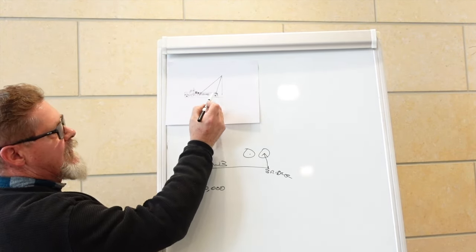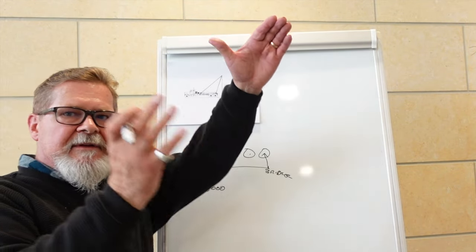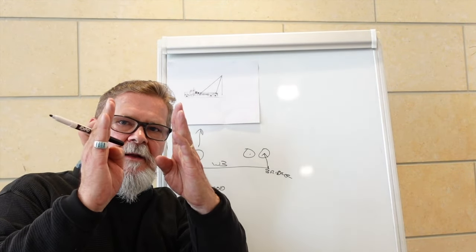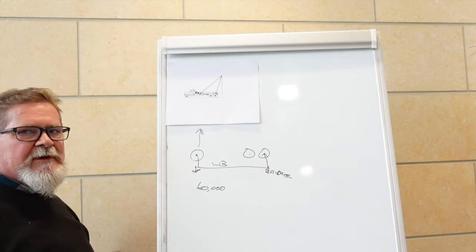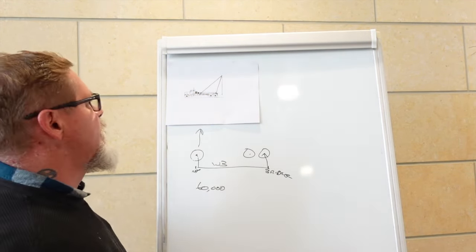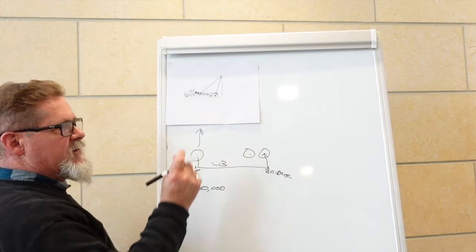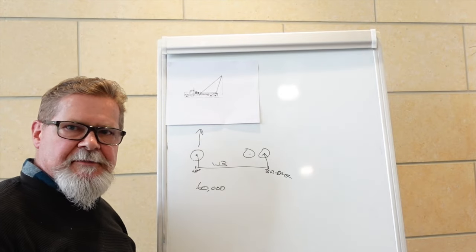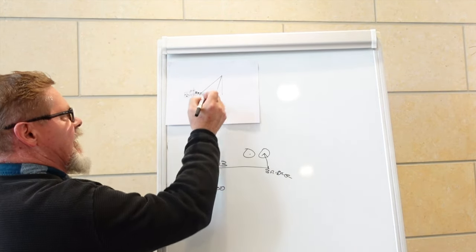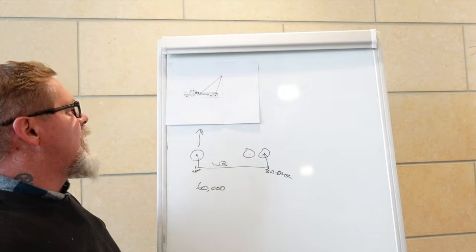By the way, the pulley on the bed is about this big, and it's about that thick, to give you an idea. And I've seen winch line of an inch and an eighth on a Tulsa 100. Blocks are typically McKissick's or Crosby's or things like that. This is not the kind of stuff you buy at your local hardware store. Anyway,